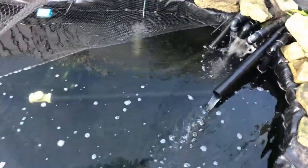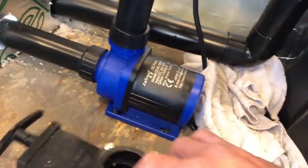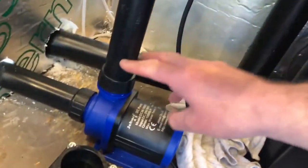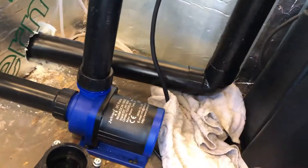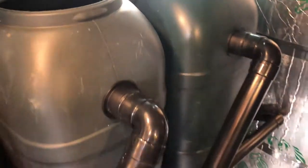One thing with having to switch it all off and get it all prepped and ready, it will allow me to come in, because obviously I'm going to have to drain all the system down again, but I will be able to get this gate valve in place then. I'm going to pop this in here with the two spacers to cut the pipe and put them back in, which means I'll be able to shut the valve off, and if you ever need to service the pump or anything, I'll only have this little bit here, a couple of inches of water, so minimum spillage. None of this bit has been solvent welded, as I've already said. That's all loose, so it's literally a temporary flow back, so I can see how much I could get it to run. It's been running for 3 hours or so. It's not overflowed on the lowest setting, but the staggering side of things is going to have to be done.